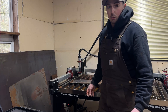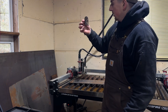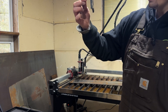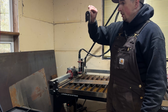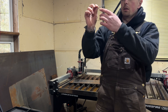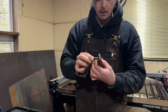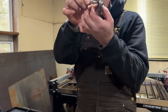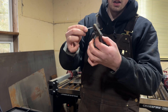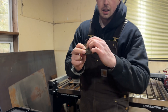I think that went pretty well - it looked pretty good while cutting. Let's pull this out and take a look. This is checker plate, so you can see that on the back. But that is very minimal dross - I'm quite happy with that. We do have quite a big bevel on there, but it's definitely a usable part. Very minimal dross, so minimal clean-up. Let's cut with the other tools and then we can compare them.